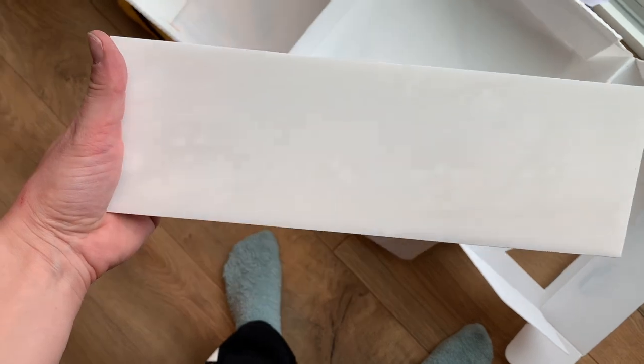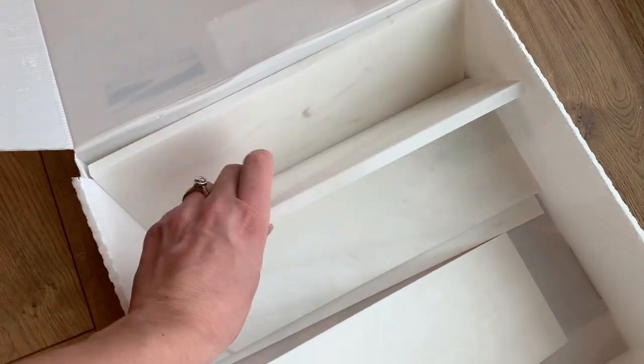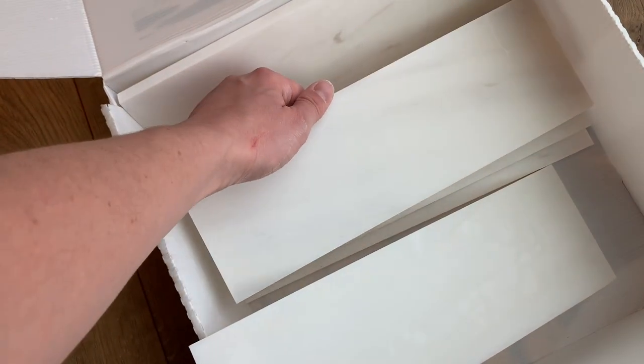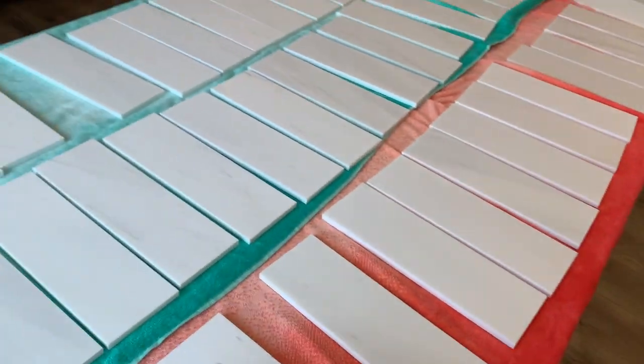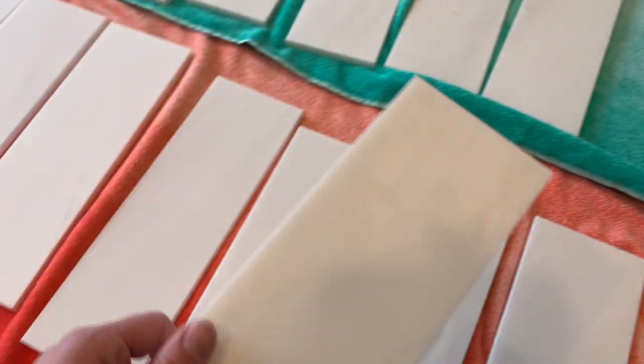Here's a good example - this one has a lot of graining and movement versus one that doesn't have much. There were only a couple damaged tiles - one had water damage and one had a scratch on the front. Any odd-looking ones I set aside for the corner cuts where only half the stone will show. Now I'm mixing up the tiles from the three boxes so there's a good sporadic mix from each box.